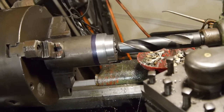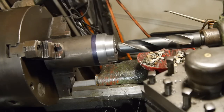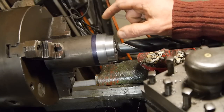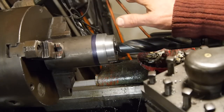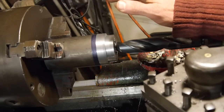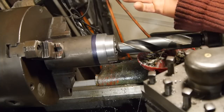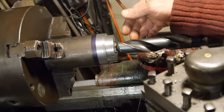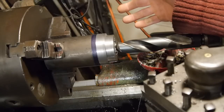This will be the last drill before I bore - got the big old drill bit in there. I decided I'm going to go with an inch and a half shaft. We'll go with an inch and a half bore because I found bearings in that size and they're on the way. The spindle nose thread is going to be inch and a half by eight - I've got to look up if that's standard, but it sounds standard enough. This is an inch and a quarter drill here, then I'll bore it.